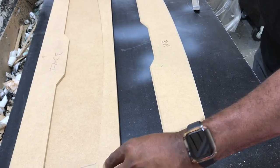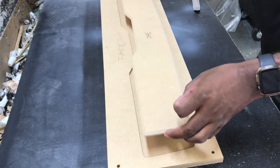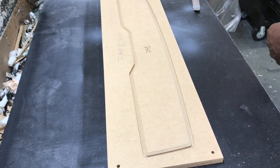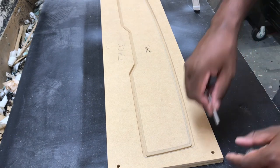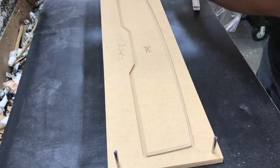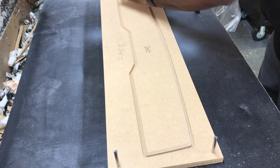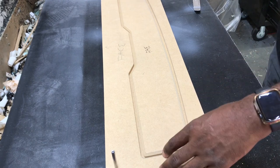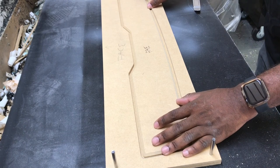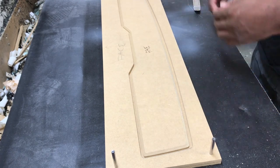Next, this goes on here and this goes in here. This is where your dowels come in handy — you can literally just push these in, get everything nice and centered, and make sure your workpiece isn't going to move. For alignment, you generally want to have this spaced out about a quarter inch around evenly.